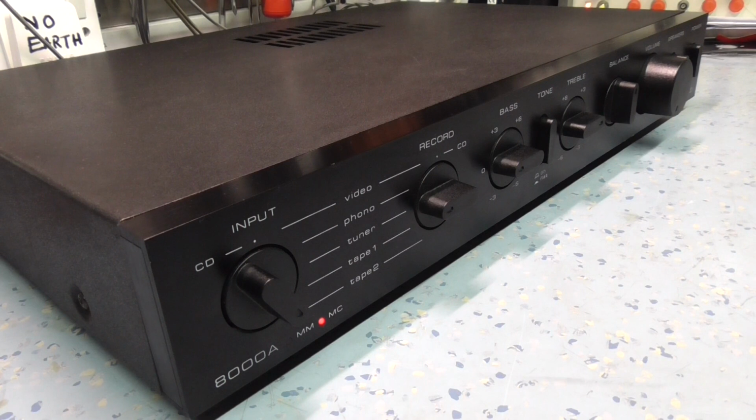So I think basically this amplifier is a good amplifier as long as it's got good ventilation and you're not going to abuse it. It has good capabilities of driving complicated loads, i.e. very inductive loads down to 4 ohms. A lot of peak current capability available from the power supply and the massive fat output bipolar transistors it uses. But it can't do that for long. It can't get the heat out of the system, basically, which is a shame because it's a very good amplifier. It sounds very nice.